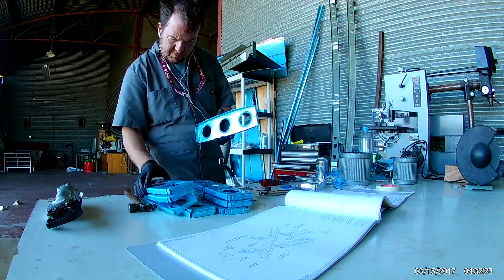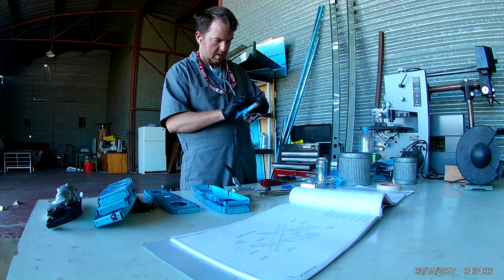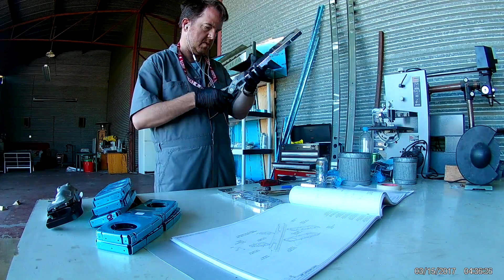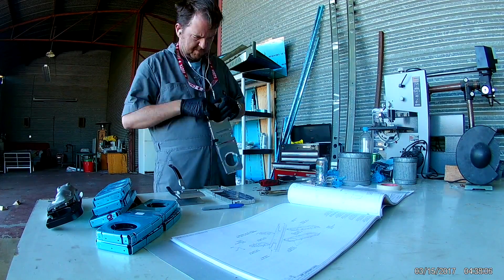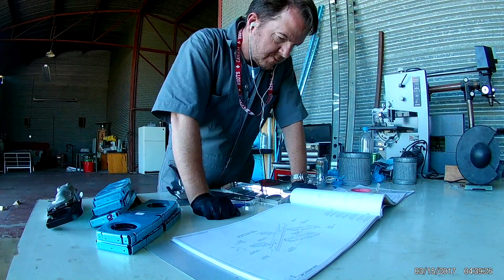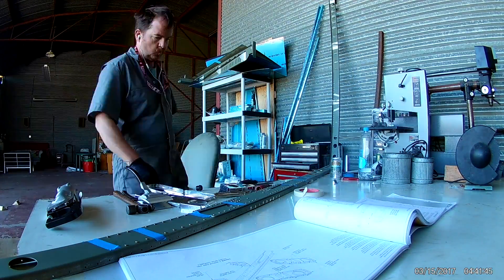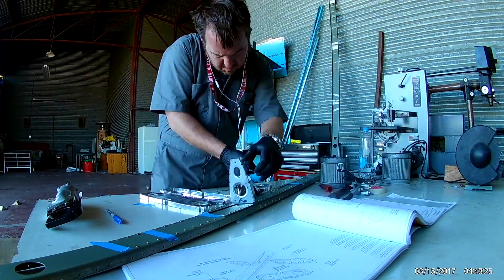There I am with my seaming tool. There are a few ribs that need to get modified — some of the flanges have to be modified from a 90 degree angle, plus or minus 10 to 12 degrees depending on which ones you need. I believe the metal is 25 thousandths thick, so the ribs are 25 thousandths — not thin but not very thick. You bend the flanges to roughly what they want; they're for a special set that go into the middle.